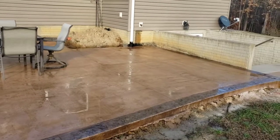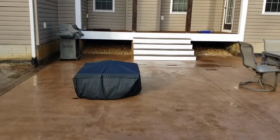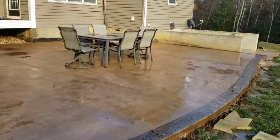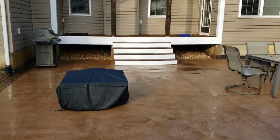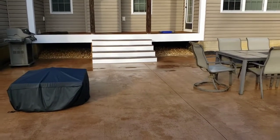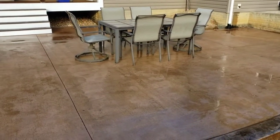This is an updated video — the concrete is done. I still have backfill to do around the edge and grass seed to put down, and I need to build that wall over there, but I got the steps up and just power washed it, which is why it's wet. This is the final product. You can see the stamped concrete on the edge with a slightly darker border. Underneath the porch I dug it out and put brown gravel and some big river rock to help with drainage. I built the steps with composite decking board. Hope that gives you some patio ideas — don't forget to like the video and subscribe.